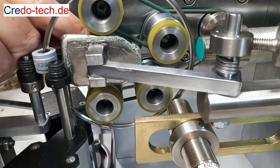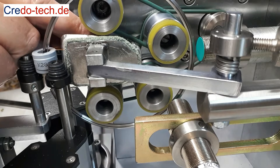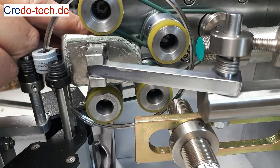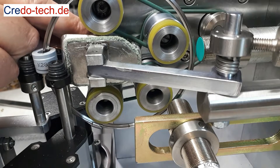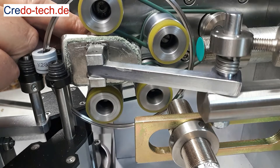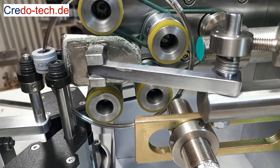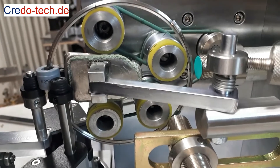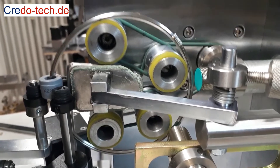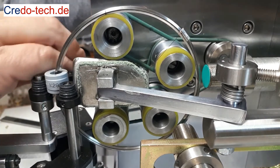I move the shuttle by hand and watch the wire. The wire must create a proper loop between the wire guide plates. The slider must pull the wire loop out of the wire guide plates. The wire must be tight all the time around 360 degrees. You can see that the wire is not loose; the wire loop is held between the two plates.